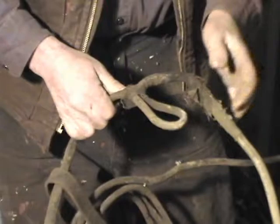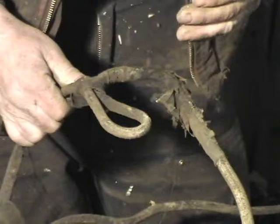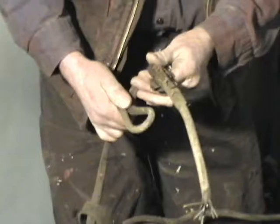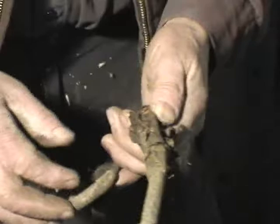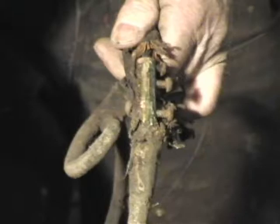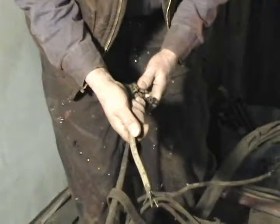The other reason we're replacing it is because it's such a mess — there are pieces cut in and out. It had at least two fires in it, which we've seen where they were patched up. For some reason they needed a piece of wire of a certain length, so they used a set-screw type connector — a brass tube with screws on the side. We will continue to use these connectors to hold the motors on, but we won't use short sections of wire like that because it's really just not good.